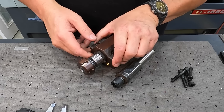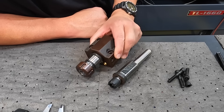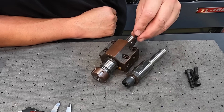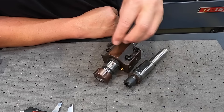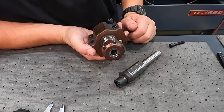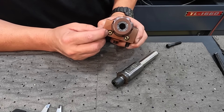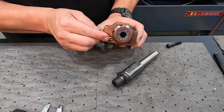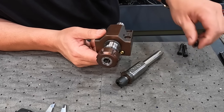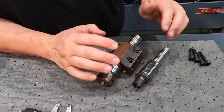This is brand new to me, these setups, and I'm looking forward to getting them going and being able to drill holes and run various programs on the Milltronics CNC lathe. These bolts hold everything down to the turret and transfer coolant through so you can spray coolant out. That's something else I need to learn — I've seen guys with little tubing connected to brass ball coolant nozzles spraying right on the tool tip. I need to get some of that hardware set up.